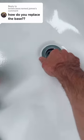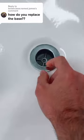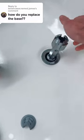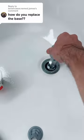If you've got an old bathtub and the drain looks pretty nasty and you want to replace it, it's really easy. All you've got to do is buy one of these tub drain remover tools. It goes in there, you put a screwdriver through there, and you twist this whole thing off.